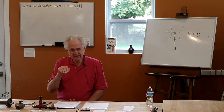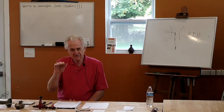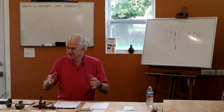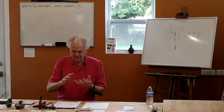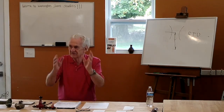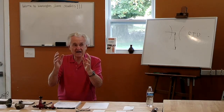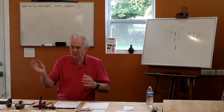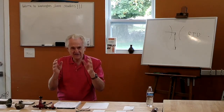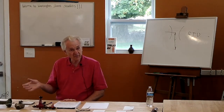So it's like running up a hill, trying to get to the top of the mountain, but the hill is getting steeper and steeper, so you have to run faster and faster. In order to fire a kiln, and to determine the size burner you need, you have to ask, how much stuff am I heating? That means the bricks in the kiln, the pots, the shelves, everything. How much heat do I need to heat that up fast enough so that it doesn't lose heat, so that I can actually raise the temperature? Because at some point I might be putting in heat at the same speed that it's being lost, and I'm never going to get it any hotter. The heat is being lost from the kiln, up the chimney, out through the walls. So I have to be able to overpower it, to get more heat in there faster than it's being lost to keep the temperature rising. That's the thought process you go through when deciding what size burner to put on your kiln.